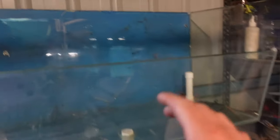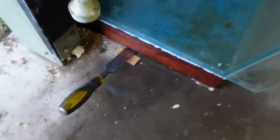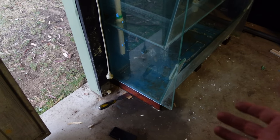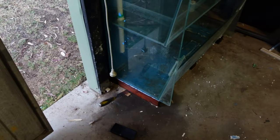I threw a tape measure down to the corners and edges of the glass — there was a 2mm difference from that side to that side on the top line. So I basically leveled it, making it parallel with the three lips. All three lips are parallel, which is good. I use a chisel and a block to lever it and then put the packers under — I don't try and lift the whole thing to get the packers under. I'm using laminate packers so it doesn't matter if they get wet, and it creates an air gap under the timber which is good for the timber.